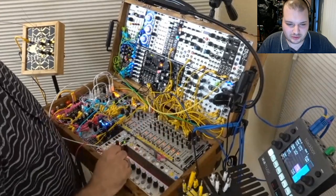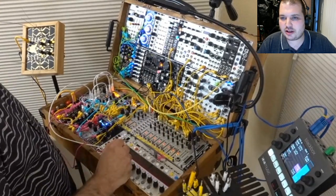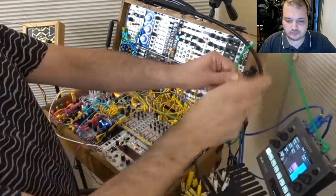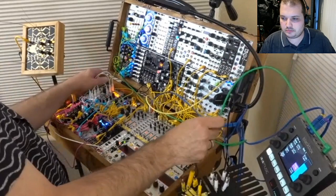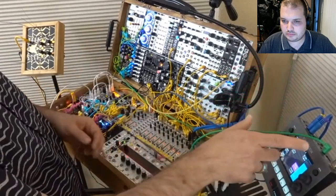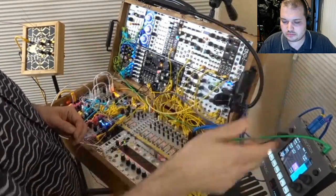Yeah. We'll hold off. Constantine did ask, with the Black Box, how are you clocking it? I'm clocking it using a 16th note clock that goes off to the split from Pamela's expander. That is the times 4 clock. The way the Black Box works is 1/16th notes. It does not have a reset, but if it does not see a clock for a second or two, then it will go back to the head.